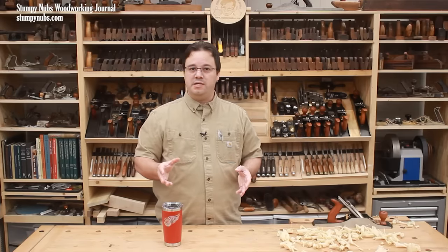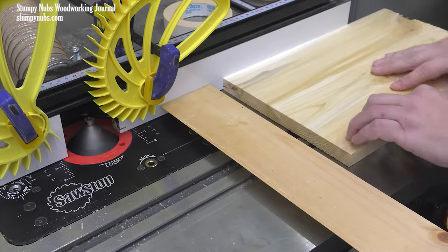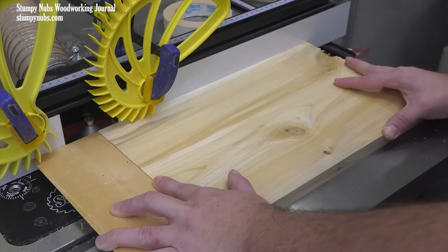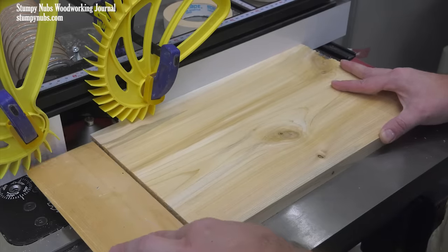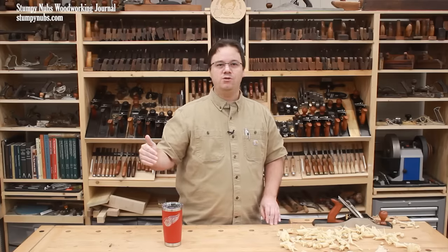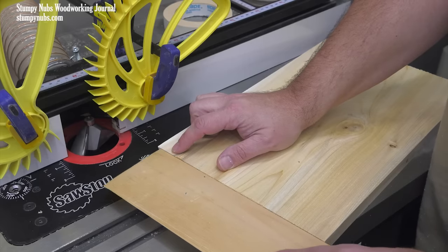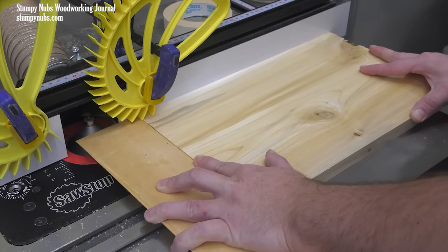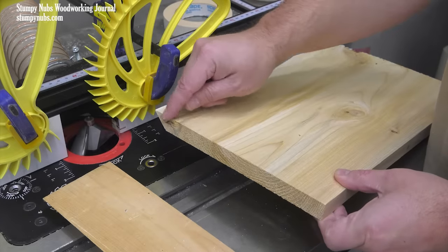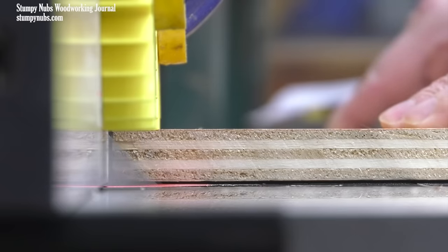Cutting bevels on the end of a narrow workpiece presents an additional challenge because you have to keep the piece perpendicular to the fence as you cut. One of the simplest ways to do this is with a pusher made from a wider piece of scrap wood. The pusher has the added function of supporting the fibers on the trailing edge of your workpiece so the router bit won't leave splinters as it exits the cut — a far greater concern when cutting a board's end across the grain than routing the edge with the grain. You must hold the workpiece firmly against the edge of the pusher so it doesn't slip toward the bit, especially if the piece is narrower than the opening in your fence. You might even glue a strip of sandpaper to the edge of your pusher to grip the board.